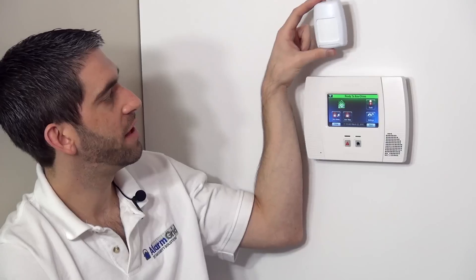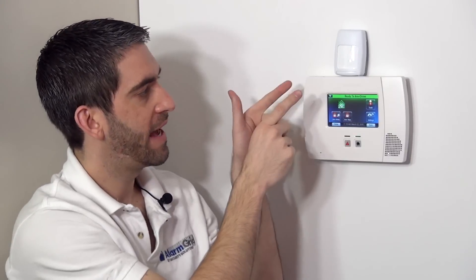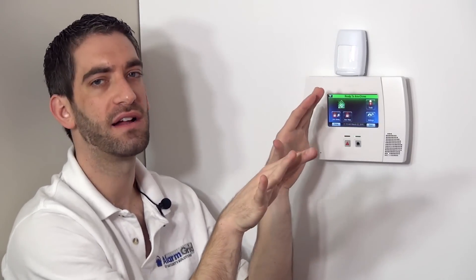This is designed so that you can temporarily mount it where you think you're going to have it, then walk throughout the room and make sure that light comes on every time you have motion. That way you know it's a good installation location, and then you can program it to the panel and permanently mount it. After the 10-minute period, the light cuts out, but the motion is still working — it's just no longer giving you the visual indication.